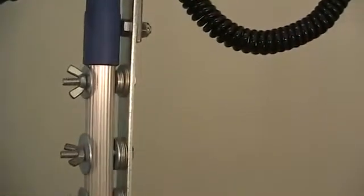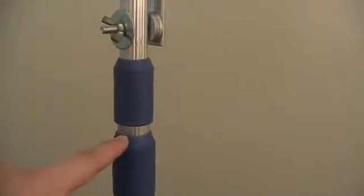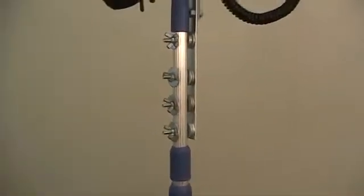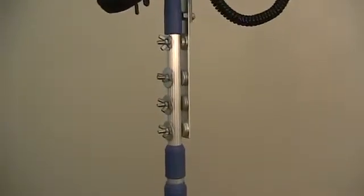Another way to increase the strength of the connection to the telescoping pole is you could even use this pole here, but drill through this second section. So it's a wider diameter, but also you would have your bolt go through 2 pipes: the larger diameter one, the outer one that you see here, and the one inside of it, this one here. So that obviously strengthens that. Just an idea. I don't think I'll be doing that, but who knows.